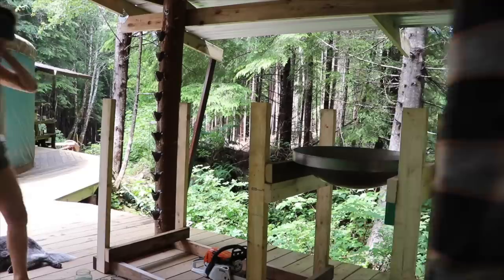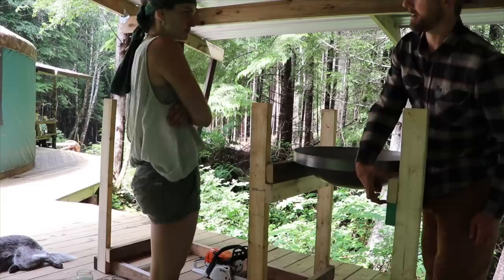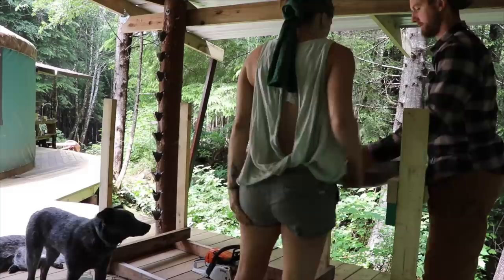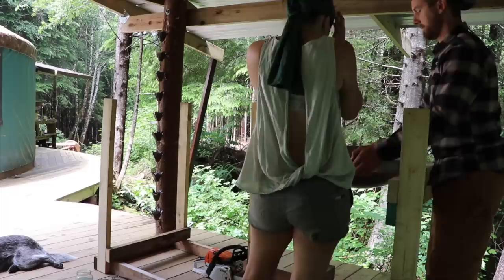All right, this is literally where it's gonna be because this board is pretending to be concrete right now. Okay. So this is gonna be the base of the concrete, and then I'm gonna put hardy backer, which is very thin, and then I'm gonna put 3.5 inches of concrete there, and I figure 3.5 inches is thick enough for the heat. Yeah. So this is 2 inches, so this lip will rest on the concrete, and I'll have a hole here, and that's it. Yeah, I think it's good.